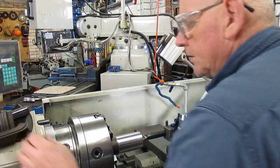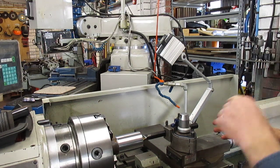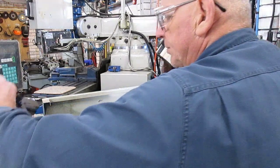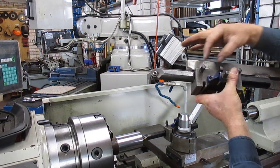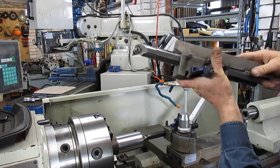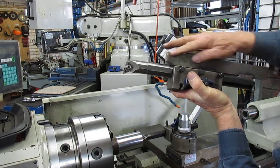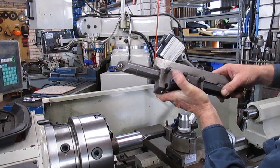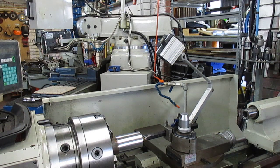The other way: I had a job with a much larger bore, and the way I overcame the slenderness ratio on that very large one was by making a strong back. The bar was held all the way out, so I welded a piece of flat bar to it, and that allowed me to hold it right out at the outside and avoid the vibration. So that's another option for deep boring.